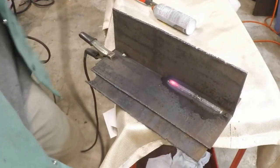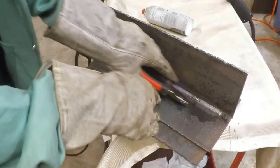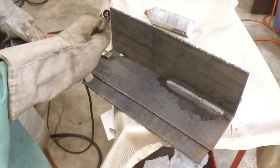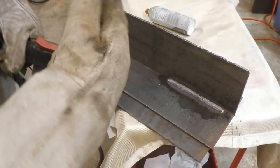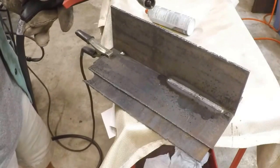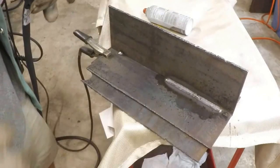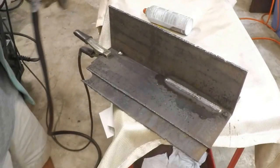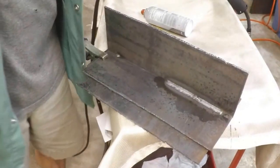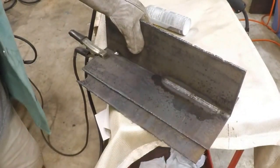In my book - not being a welder - you've got to love that. Works beautifully. The feed rate, the wire feed out good - that's where I restarted - and we're not getting a lot of slag buildup on the end, which would probably be more my fault than the disposables' fault. It does come with a 0.8 millimeter tip, which is a 32-thousandths-inch tip. I bought an extra 32-thousandths, bought new cones and diffusers - the disposables - when I was picking up the torch. I love it. It works wonderfully. Made me look like a pretty decent welder for the little bit we welded there.